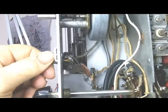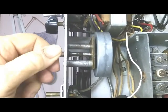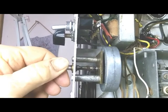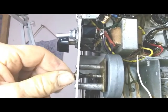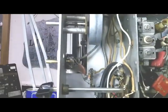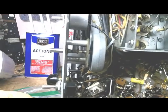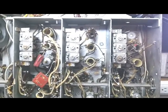By the way, I did restring this band spread dial, and oiled all the bearings everywhere. There's a dozen little wheels that these dial cords run on. Oiled all of those. You can actually spin this band spread and it'll keep spinning. So all of that's working. And so now we're going to make another attempt at alignment. Okay.